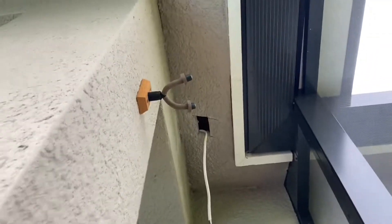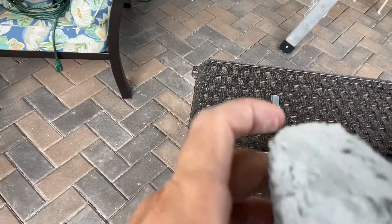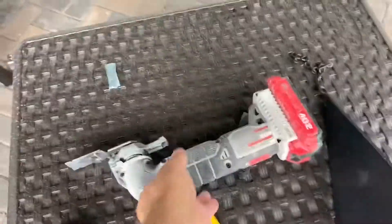Now I wanted to run this wire — it's all open up there — and put an outlet right here. I already cut for the box. Here's what I cut out: a big hunk of cement in between this metal lath. I used my cement cutting blade on my grinder for most of it, then finished it off with a multi-purpose blade. Cut that out, I will pop this in and put the outlet in.